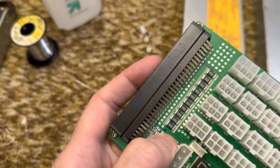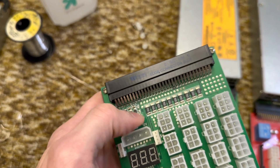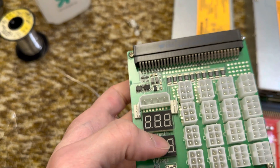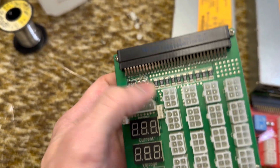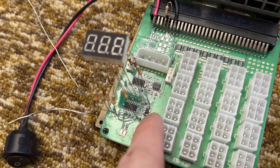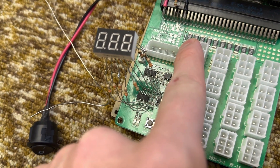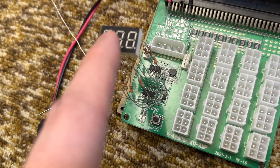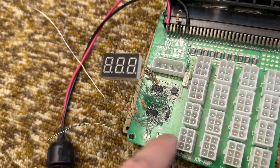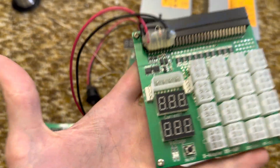This line here is the power running to the thing, and this is the sense lead running past the resistors. The trouble is you can't just switch one of these leads — you have to switch them both, because there's a capacitor underneath, decoupling between those two leads to minimize transients. So you'd need to switch both, which makes it a lot more complicated. You'd basically just want to put a switch in here to turn these on and off. Otherwise these are totally independent. There's a little 5-volt regulator that powers both chips with a lead running between them, but if you put a resistor on there, that regulator chip gets lower voltage and the sense lead for the voltmeter gets less voltage too — it just shows lower voltage. Not that I care about the voltmeter, but that 5-volt regulator is also necessary for the top current section, so you can't really modify it externally easily.